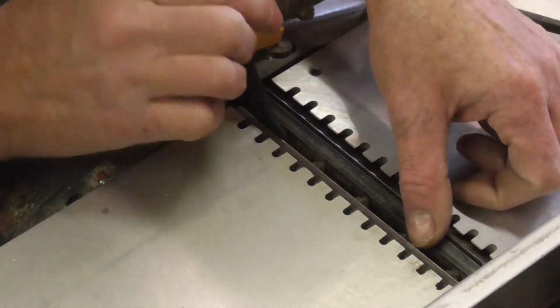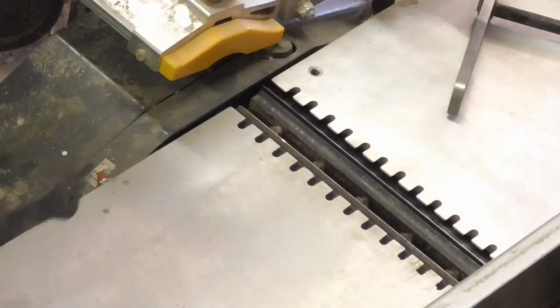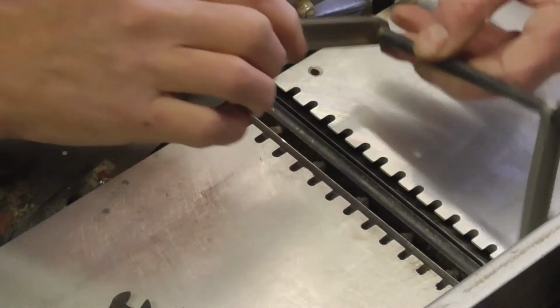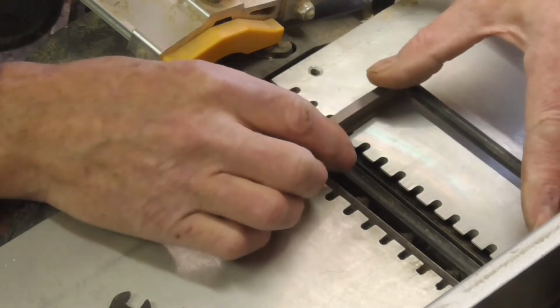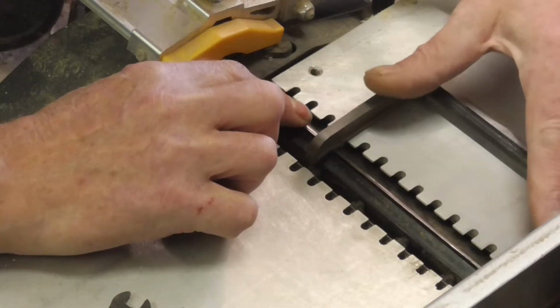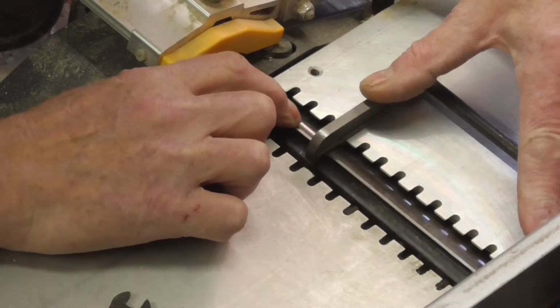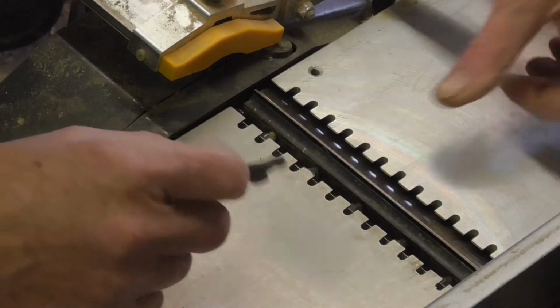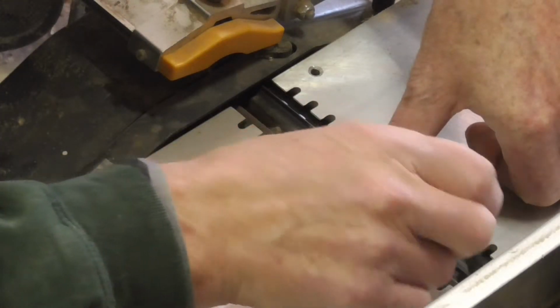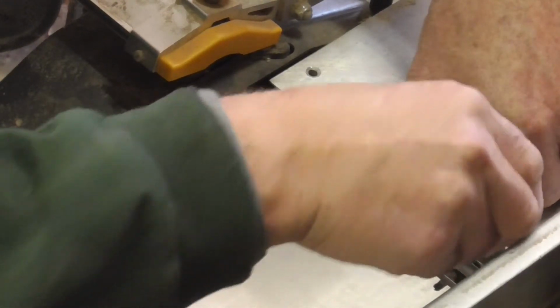Once the blade's clamped sufficiently tightly, it's easy just to remove the jig and tighten the rest of the bolts up, just making sure every now and again that nothing has slipped by replacing the jig. Then it's a case of doing a final tighten on all of those bolts. Blade 1 done.